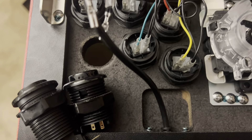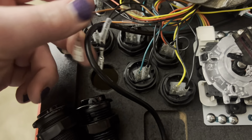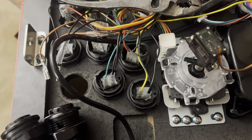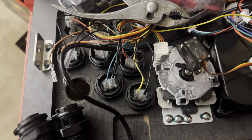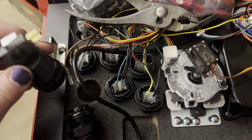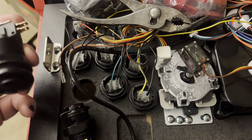So what I'm going to do is one button at a time. The reason I'm going to do that is so that I know what cables go to what button. If I do it one at a time, I'm not going to mix those up. It just makes my life easier than marking them. So we're going to do one button at a time — take this black button, push it through, connect the micro switch, connect the wires.